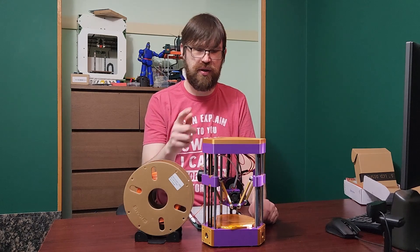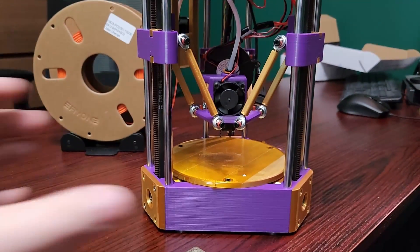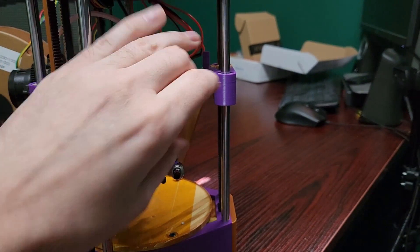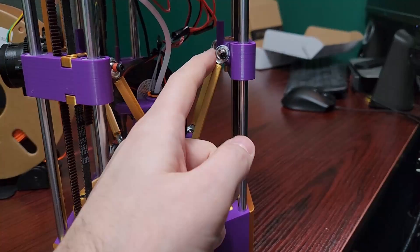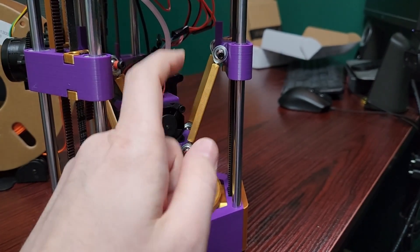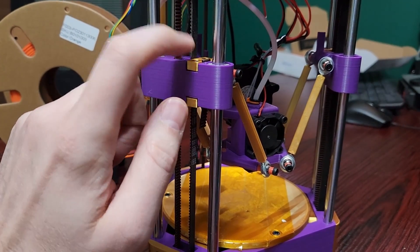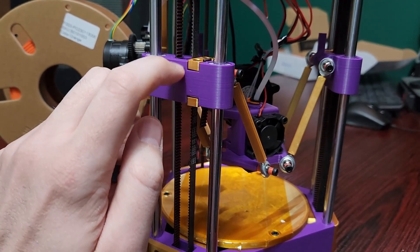Here is a quick overview of Min. It's mostly 3D printed — you can see the printed arms here; they're very small, and 3D printed arms definitely work. You could also use some carbon fiber tubes if you wanted to mod that, just epoxy the arms in. These ball arms have quite a bit of thread, so there's a lot of material to glue in and make nice and strong. This version is a prototype with clamps that clamp the belt down, but the latest version on Printables has a wraparound belt system.